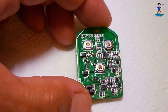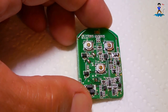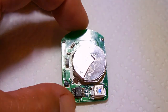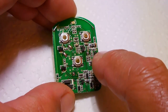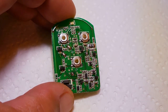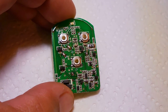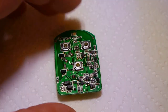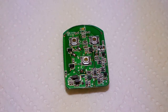When the switches become faulty again over time I can easily desolder them and install new switches. This is what the back of the board looks like. I took my digital multimeter to test some of these diodes and resistors, and it's very easy to probe each side to get a reading. There's very little if any clear coat on this board on the soldered areas, so if this did fall in water — especially salt water with the battery applied — more than likely it would short out and be gone forever.